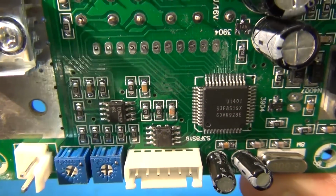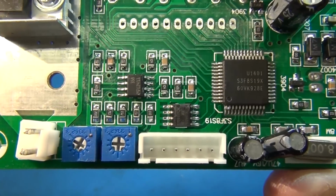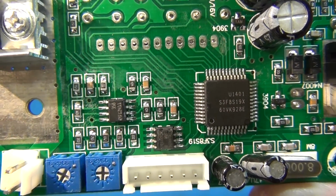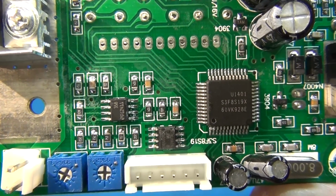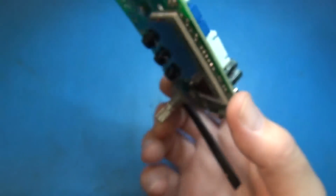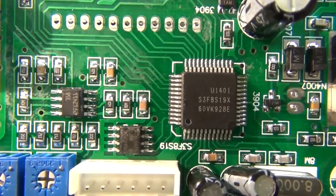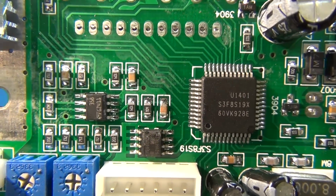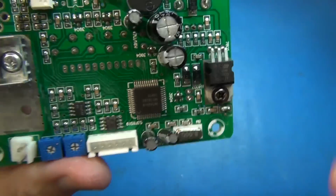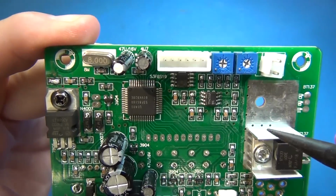It comes out to something that's a 48 QFP package with 32 kilobytes of flash, 2K of RAM, a couple of UARTs, I2C, a serial peripheral interface, an ADC, 10-bit even, believe it or not, in that. An LCD screen driver. Well, that makes sense. There's an LCD on it. It probably uses it for that, if it couldn't just drive it with its own software. Up to a point. At any rate, 40 GPIOs and timers, some 8-bit timers. Yeah, so quite a powerful little chip there for controlling this. They didn't skimp on the micro.